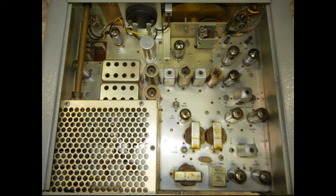So based on that rating, a pair of 6DQ5s could be running 200 watts DC input and an RF output of 130 watts, assuming 65% efficiency, class AB1. That would result in 70 watts dissipation for both tubes, or 35 watts per tube — so this is not a problem. It would certainly run for single sideband use and CW, and I contend this will even be acceptable for half-hour key-down conditions under radio teletype use, RTTY.